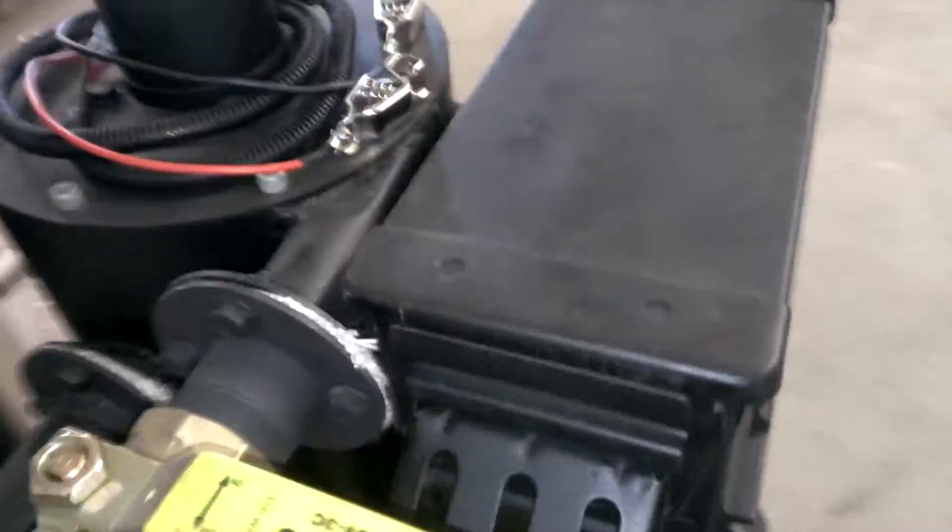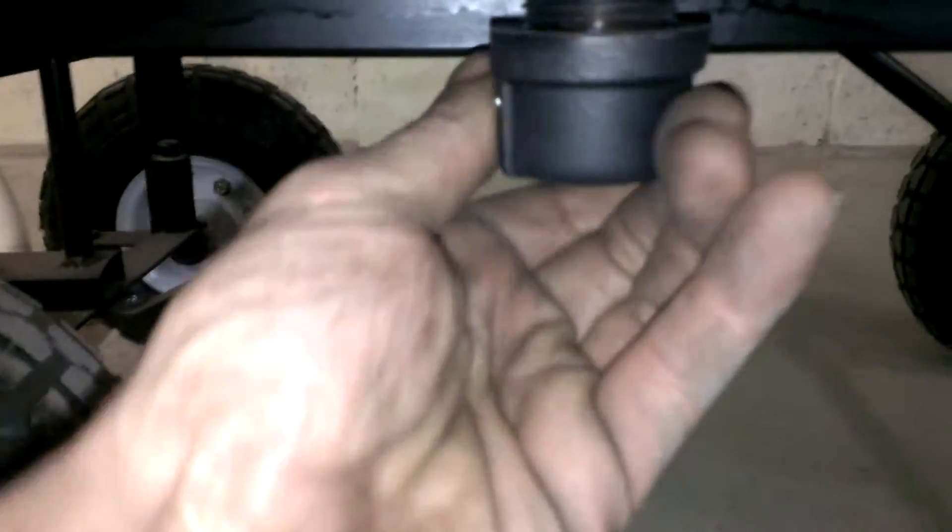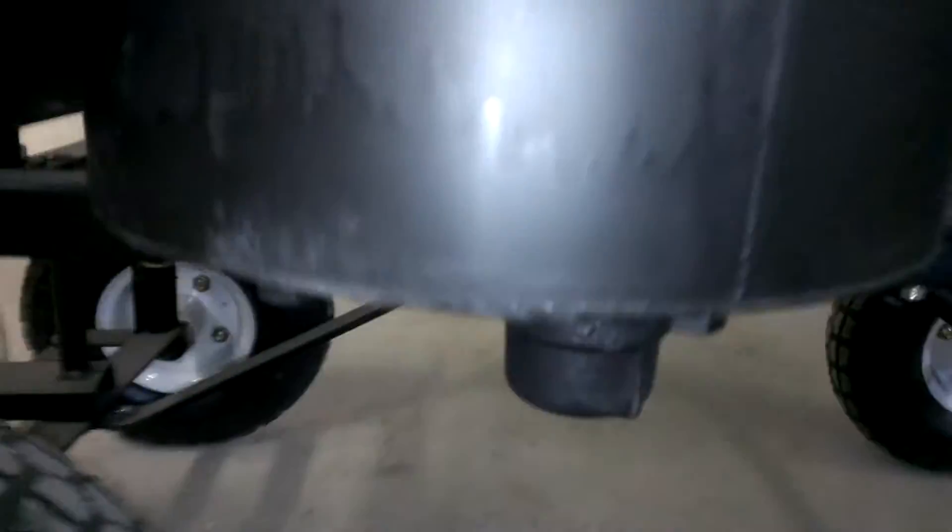Next is your condenser — this is your cooler. This is how you drop the moisture out of the gas. Down here is your tank, and below that is your drain port. You can put a ball valve on there to drain it and make it easier.